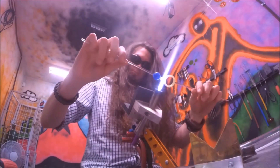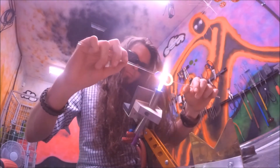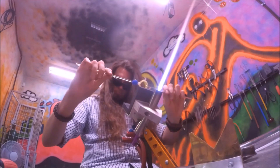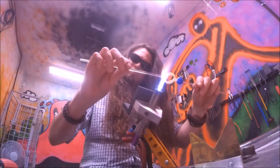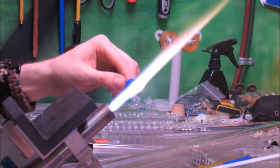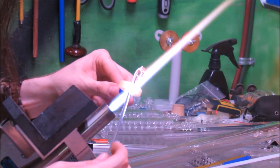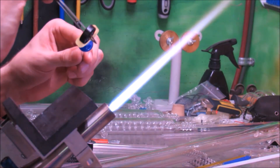Finally, assembly. Every punty needs to be centered — it'll help to keep everything balanced. Attach by pressing firmly, then slightly pulling back out, making sure everything is centered by rotating until completely solid. Try and heat only the outside of the ring; it will help to not distort the center bore. Checking to make sure the bearing still fits.